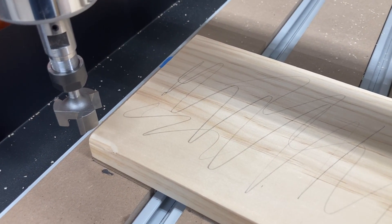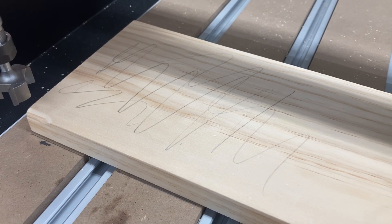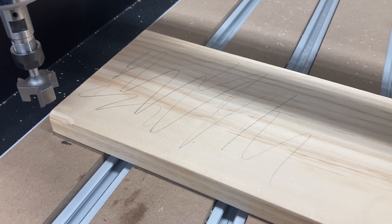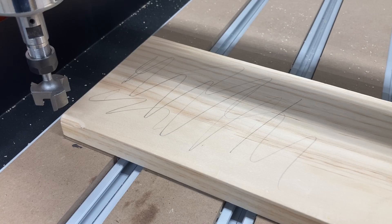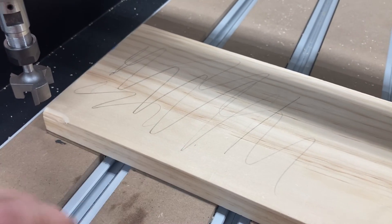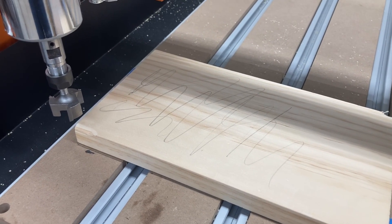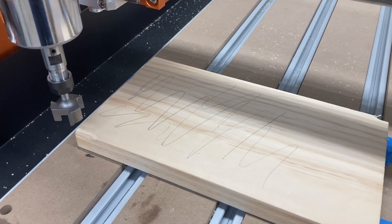If not, that little variation would definitely cause a problem. I took a pencil and just scribbled across the surface. That way, if there are any high spots left over and that pencil line still shows, I need to go down just a little bit deeper. I'm planning to go down a sixteenth of an inch. This wood is already relatively flat, so I think that's going to take care of it. And with a sixteenth of an inch, I'm going to do this in one pass.